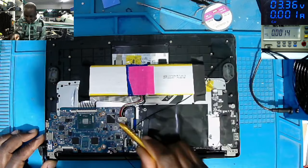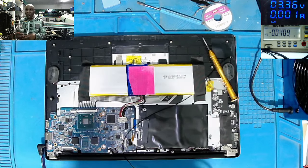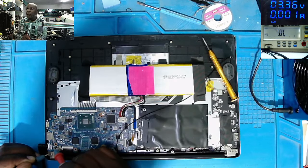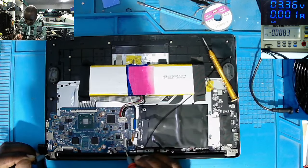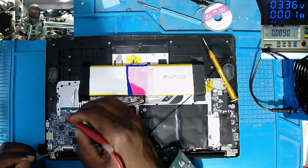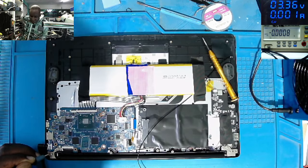We have the battery — like two cells — and the charging port. Let's check for voltage on the charging port; we must have 12 volts since this is a 12V charger, so the main power rail must be 12V. Straight on the charging port you can see the voltage. Checking the power supply inputs, we have zero. Checking the ceramic capacitors around each power supply, on the input of each we must have the main 12V, but the 12V is missing.